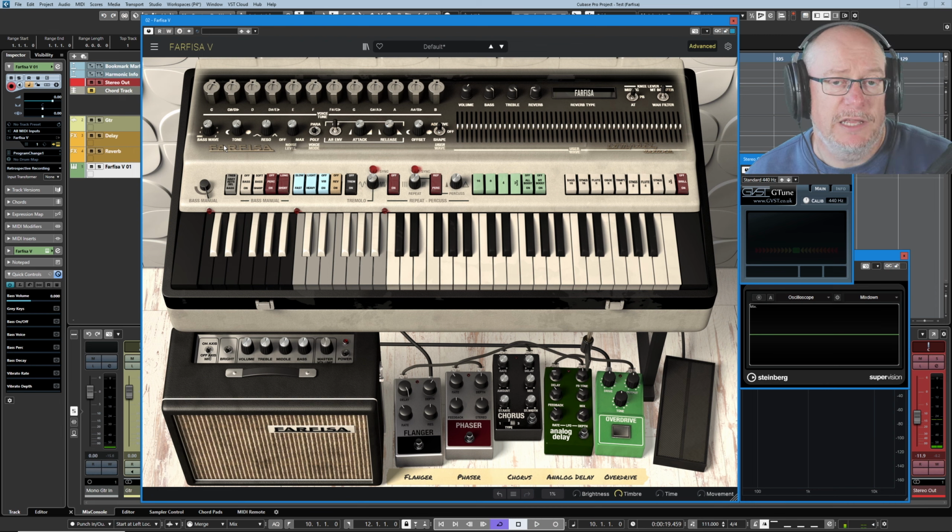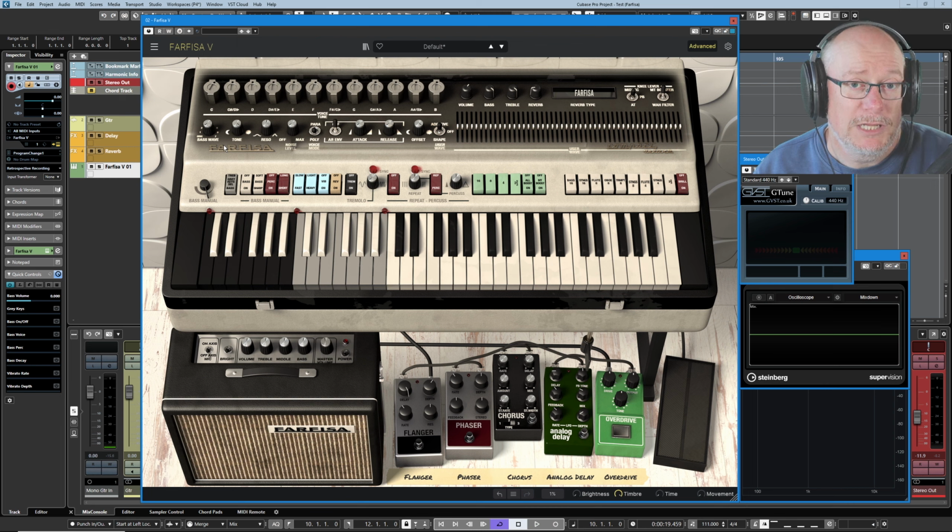That's achieved via a thing called a frequency divider. Essentially, the oscillator is generating a single tone, and then it uses a relatively straightforward mathematical process to divide that frequency up. Obviously, every octave you jump up, the frequency doubles. And so a frequency divider is effectively able to generate the highest pitch and then simply divide it as it goes down the octaves. This was a fairly common technique for vintage tone generation before we got to the stage where oscillators were capable of generating any pitch on a much larger range.